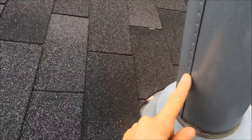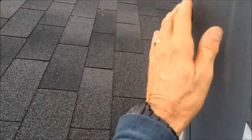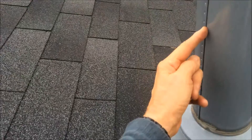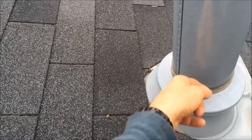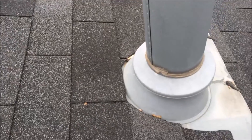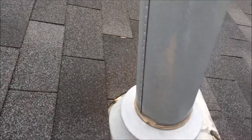Also, you have a vertical seam. Being that this is not sealed, when it's driving rain, the water can get inside through that seam and then bypass the caulking and the flange and leak inside the home. So this is very simple — we'll just take off this old caulk and seal it with polyurethane, and then we'll seal the vertical seam as well.